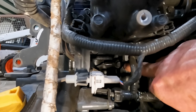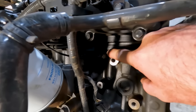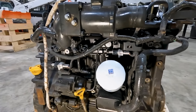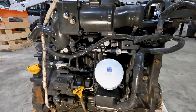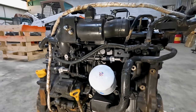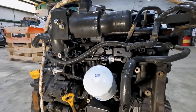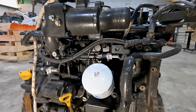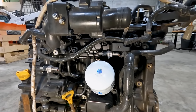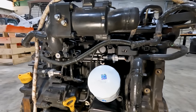This round sensor back in here is called an accelerometer, and there's one on each side of the block. These are like knock sensors. If you ever get an accelerometer error, they're very sensitive to torque — sometimes just loosening and re-torquing the accelerometer to spec will clear the code. In my experience I've never had one actually go bad; it's usually a wiring issue or just re-torquing. The accelerometer detects combustion, which feeds the minimum drive pulse and helps the ECU determine when combustion is occurring on each cylinder to get injector timing set right.